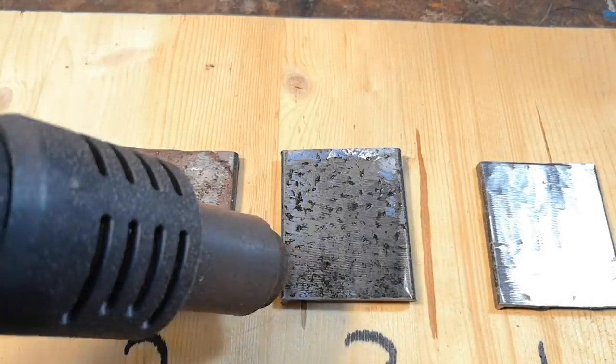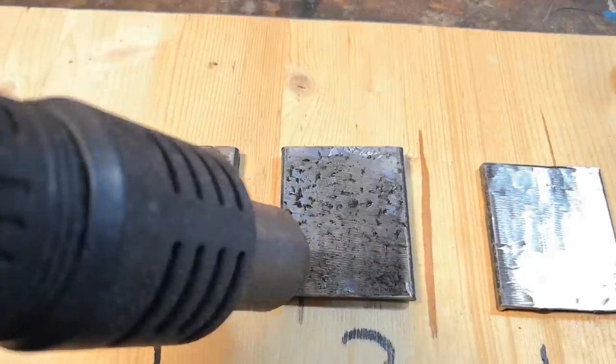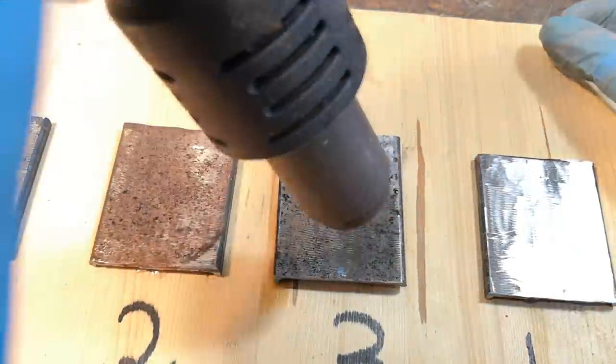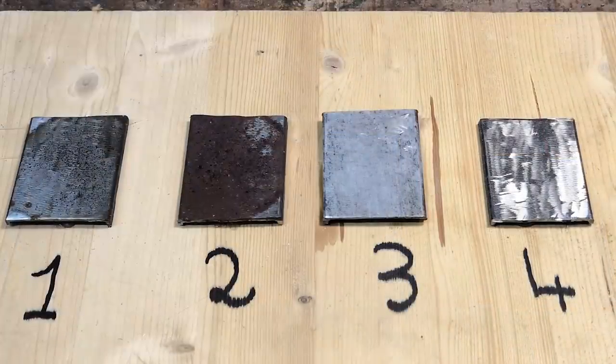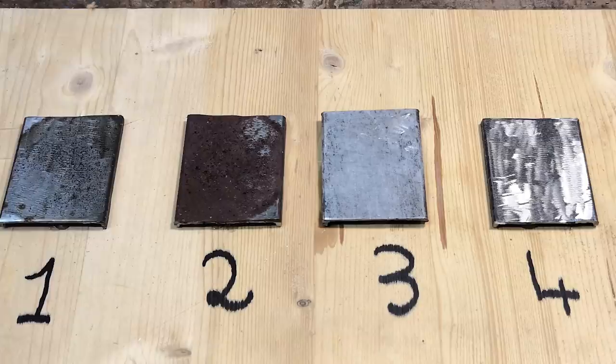In those cases, it often happens that a lower concentration of the salt is more effective in promoting corrosion, so I decided to dilute the residues on sample 3. Again, at day 10, after another 3 days, no trace of corrosion was visible.